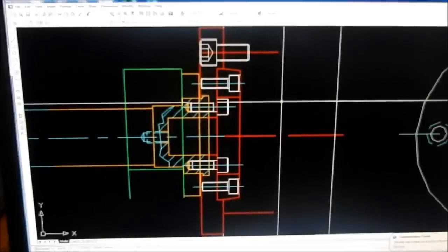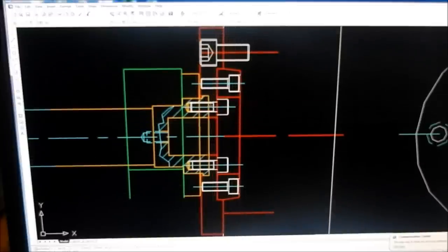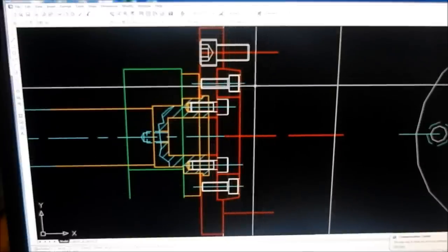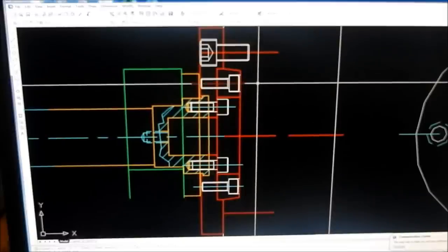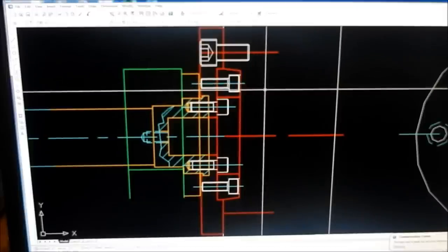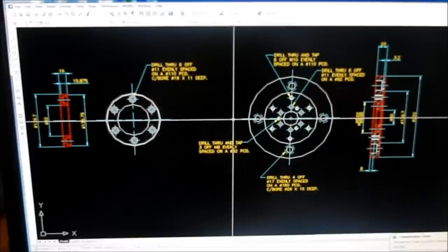So that's the arrangement there for the nose, showing that D18 taper, how the adapters fit onto the nose piece. And I've done these sectionally, if you like, or what I call cartridge design. It just makes it easier. If I am machining it in my own workshop and I stuff up one part of it, it's not a complete throwaway. So it's not a great deal of extra effort to do it that way for me. And then I just detail that through.